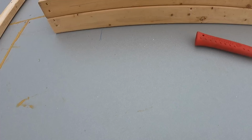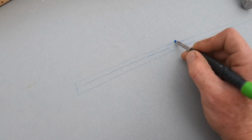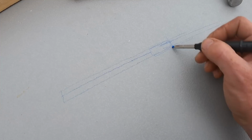we've got a beam or a double beam, one on each cabin, they need to sit on the wall that runs down the whole of the cabin. Now this wall is thinner than the beams, so we'd have to jump up to a thicker wall to make sure they're bearing on it properly. But if I just change the last few studs, we'd have this join here. The other option is to run a sheet of OSB or ply over to really give that strength to the wall.